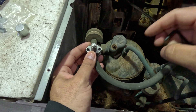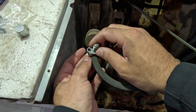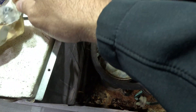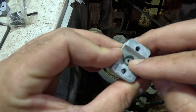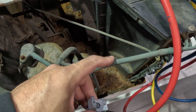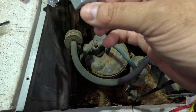Actually, it looks like I was wrong — this one is too small for this pipe, so we may have to go with the half-inch A2 version. This is an 18,000 BTU LG air conditioning unit, so we need the bigger size. If you notice, this one has a different gasket — a little rubber ring — and that's why you can't install it on the high-side line, because that line gets hot and this rubber gasket will actually melt and you'll get a leak.